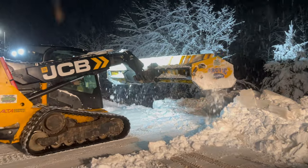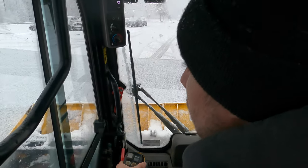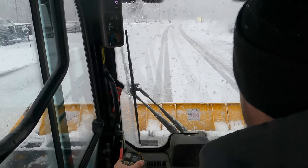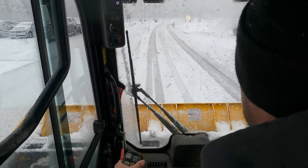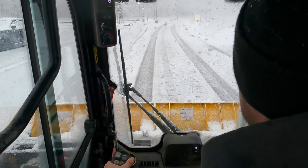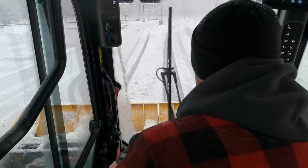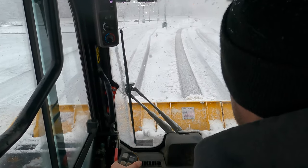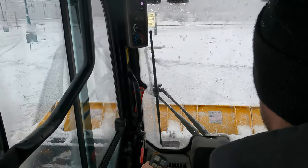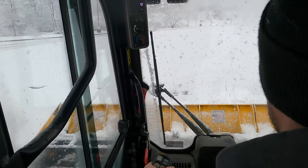The studs didn't seem to do too much damage to the pavement — they may leave some scar marks but nothing crazy. Plowing, especially with the little film that's left on the tar after you plow, seemed like it didn't do any damage at all. I feel like chains would probably scuff up the pavement a lot more. Obviously chains would be better for gravel or anything in the woods, but on pavement I think these studs are the way to go — the cheapest option, and they won't damage your pavement as much as chains.